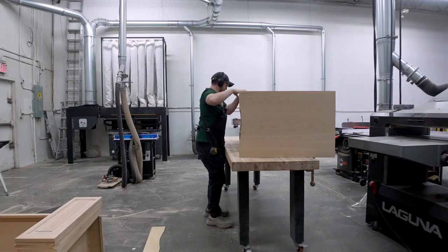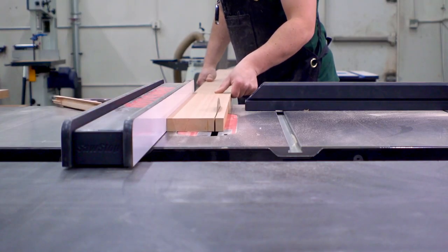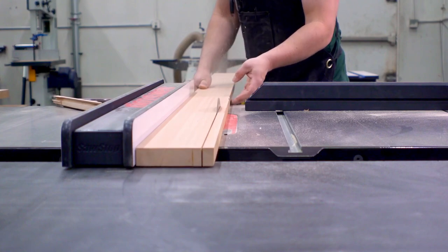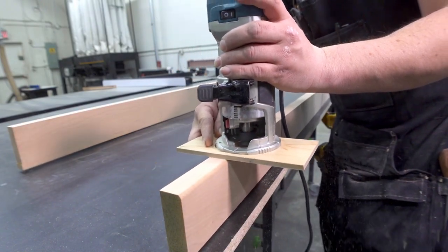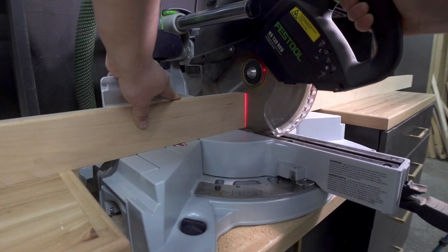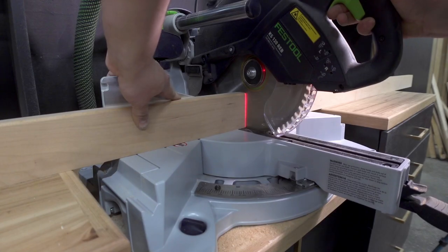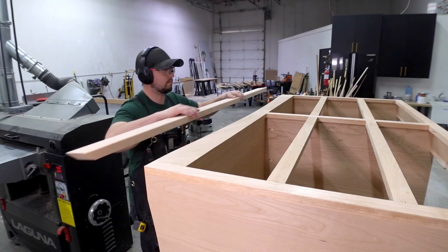Now trust me, I'm as ready as you are to mount those dang legs, but we really have to add the final skirting first because the position of the legs is pretty dependent on the skirt. This is a very simple square profile with a 3/16 roundover on the top edge. The miters are easy enough to cut on an accurate miter saw, then the pieces can be dry fit to check the lengths.